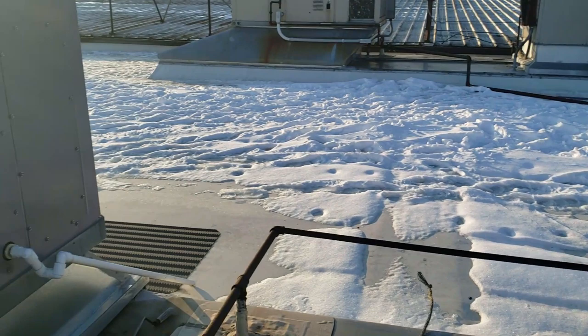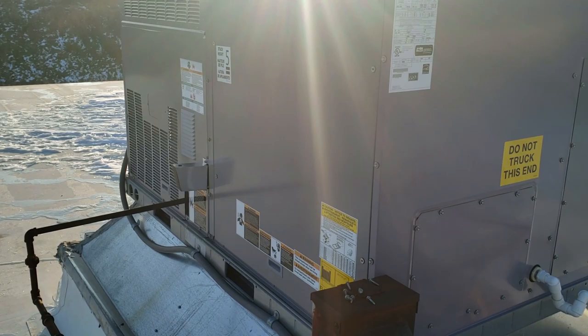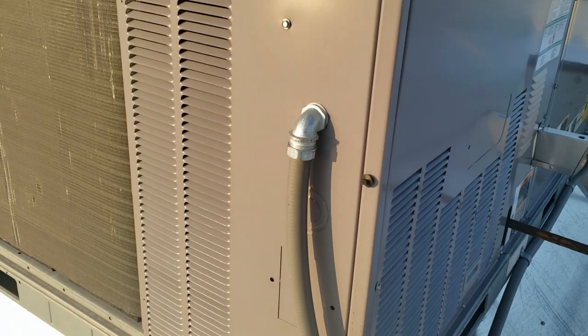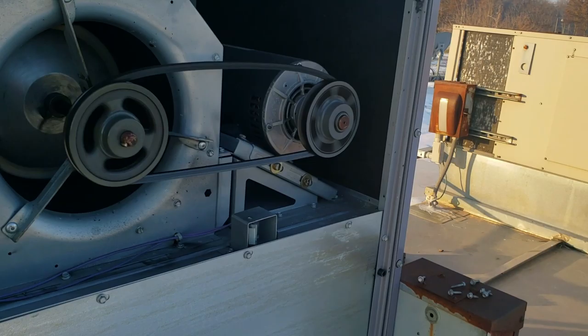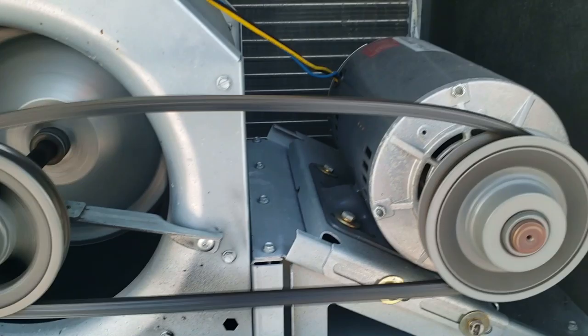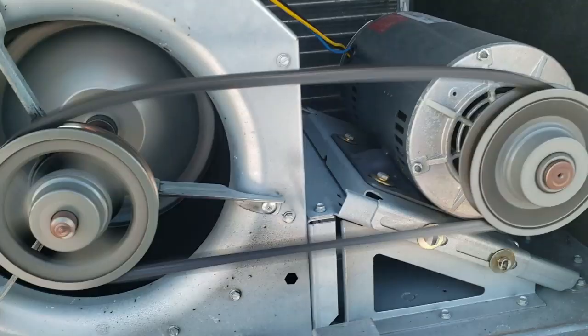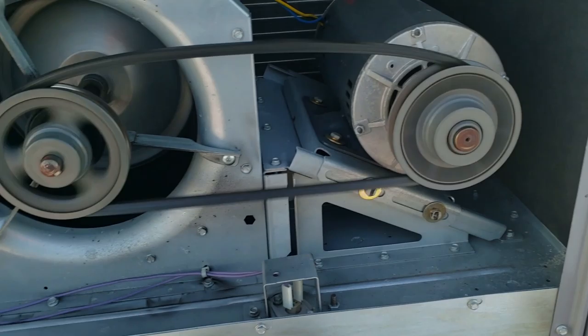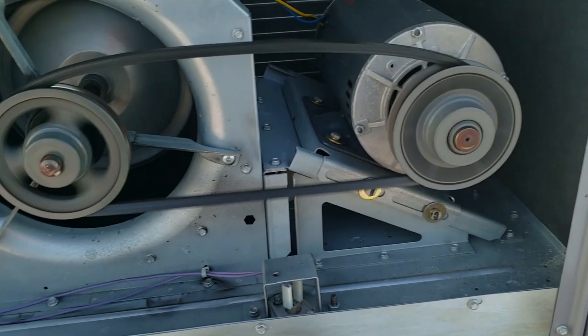Got a unit here — of course there's 4 other ones up here — and we're hoping this is the right one. They're not open yet. From what is described, the newest one is not heating the area. Feels like it's running to me, so we're going to check the belt first thing and filters. The most obvious things usually are what takes these down. That right there could be an issue. You can hear the speed difference — there's so much slipping going on right now on that pulley that it's not running the CFM that it needs to.